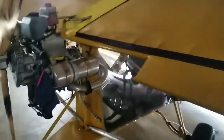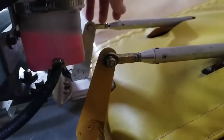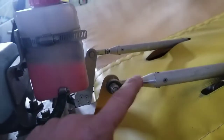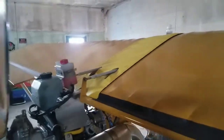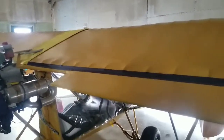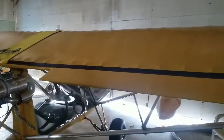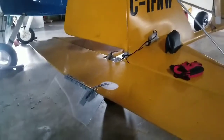This, as it turned out, is exactly the right trim for me in the front. I also put a little bit of reflex into my flap runs — took up the extra slack, ended up being about two and a half turns. It's gonna be different for everybody's plane. It brought my stall speed up slightly but not that much. Now that I actually have electric flaps working, I'm able to drop my stall speed down — I'm down around 35 to 37 miles an hour in my stalls.